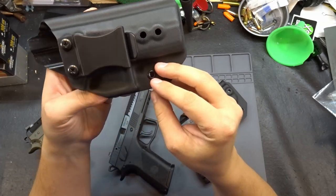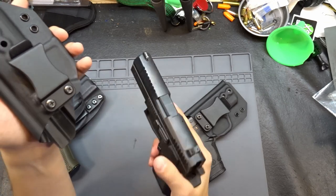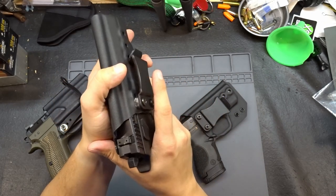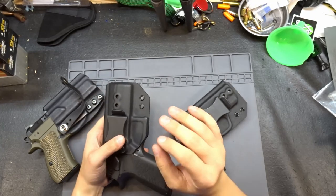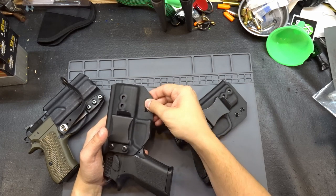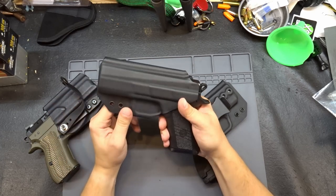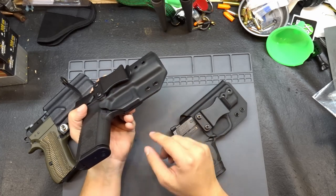These are molded on CNC molds, and it's a really cool process. Essentially, what it gives him is the ability to properly shape every single holster he has so that it has perfect retention. He actually runs fixed retention, and that's because of the tooling style he uses. Oftentimes people have to run adjustable retention because they can't get the tolerances around these areas as tight as they need to be to give that consistent snap. But this new tooling will give you that every time without the requirement of having adjustable retention.